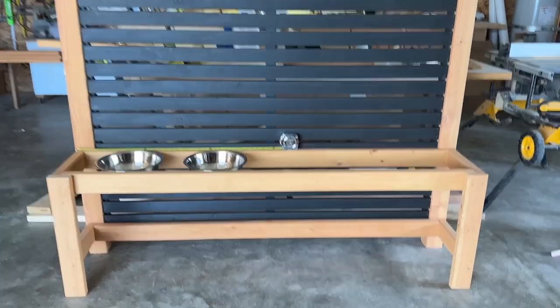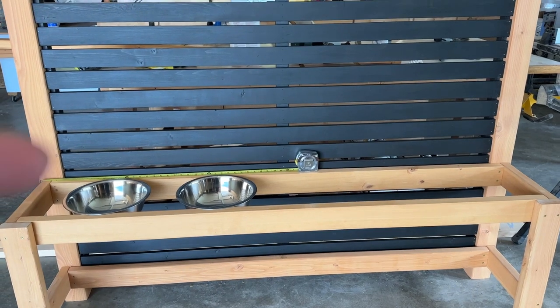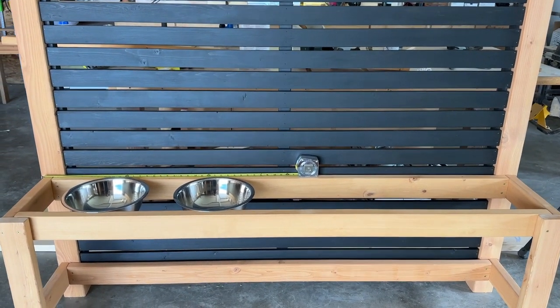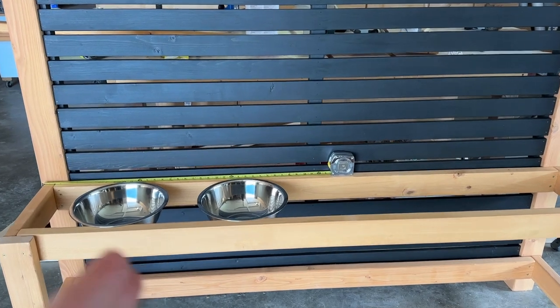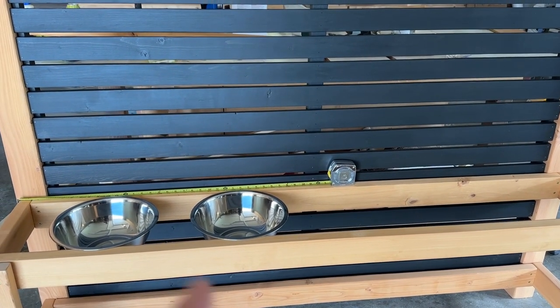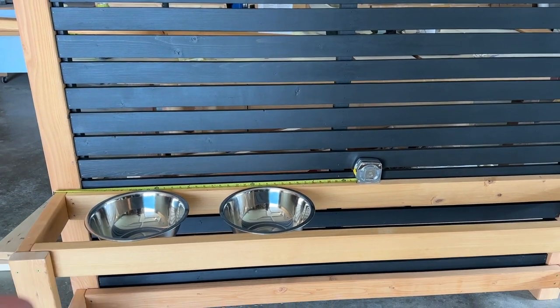as sinks. But my countertop is not going to be one solid piece. It's going to be a couple 2x4s that'll have gaps between them to let the water go between them and so that things don't get caught in there. But as I was just thinking it through, I realized I'm going to need some extra bracing on each side of the sink so that once I cut the holes out for them, I don't just have free hanging 2x4s because they'll just fall in.